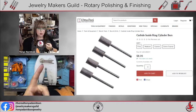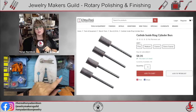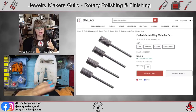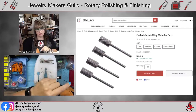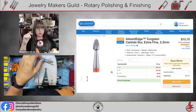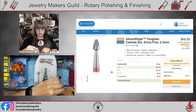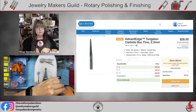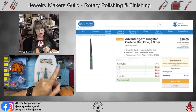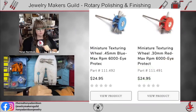These are carbide inside cylinder burrs — brand new, but worth considering. If you want to remove material on a ring to make it a bigger size, these could be your project-saving burr. The small rounded one is great for getting down into divots, around corners, and making a nice rounded shape on an edge for a decorative finish. The fine straight one is what I reach for most — it gets down into corners and grooves, and is a great tool for removing solder. Worth every penny.